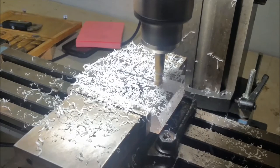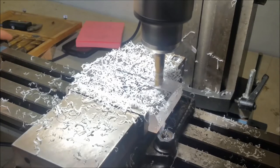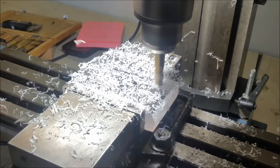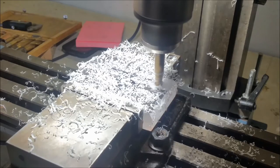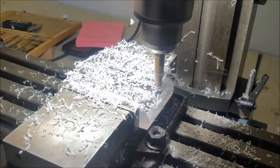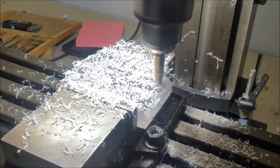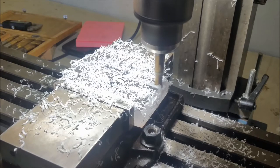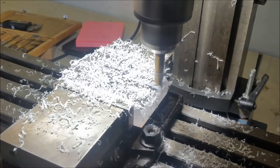So on my power feed, what I'm noticing is that it's not jamming up, but unless you've got it incredibly sloppy, it doesn't drive. I believe this is a Grizzly driver. I found the manual for it, and there are some potentiometers in there, and apparently one's torque, but the instructions don't tell you. And then I looked for a replacement board as well,